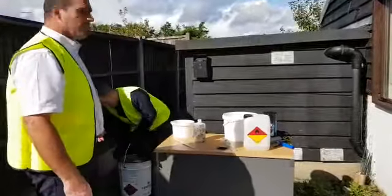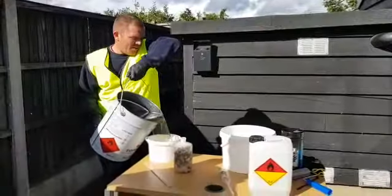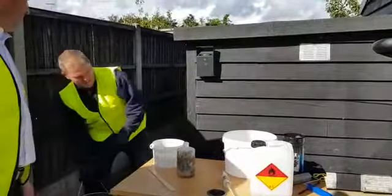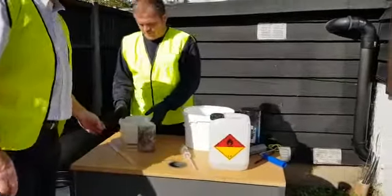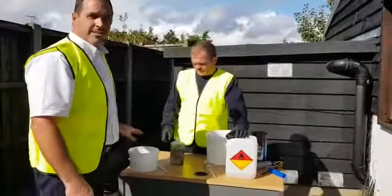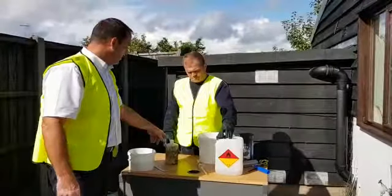What he's doing is, obviously, we've got the resin — we've got the roof-based waterproof resin coat — so it's just tipping in the resin. Quantity-wise, we've got about a litre and a half in there, so we're not looking to put less than 1% and no more than 4% of the actual catalyst itself.